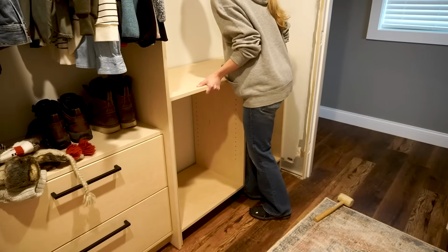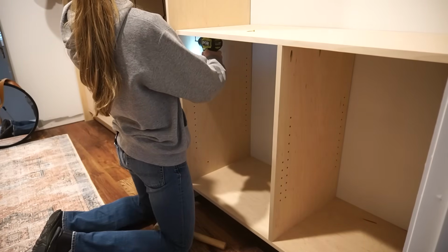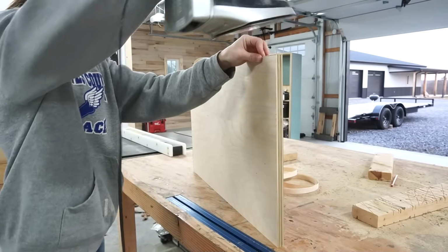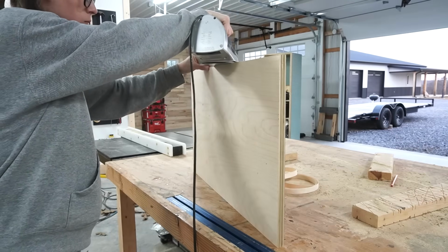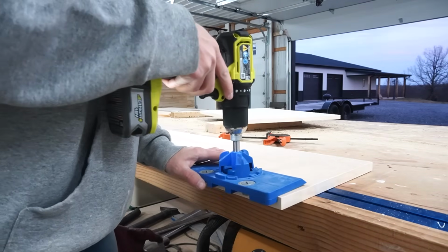Then I carried this cabinet inside and installed it in place in the closet. I secured it to the cabinet next to it and to the wall stud to the right. Now all that was left was the finishing touches. I added a baseboard to the back of the closet and replaced the door trim that I had removed at the beginning. And I have a separate video on door and window trim that I will link below if you want to know more about that.